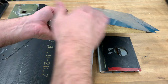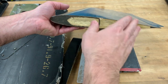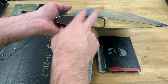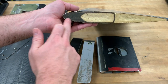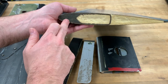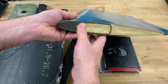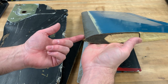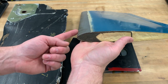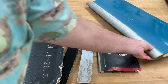Composite blades are made up of a composite material — could be carbon fiber, could be standard fiberglass — but they are much stronger with a longer life. You can see the D-spar here, which is also carbon fiber or composite with a resin impregnated. Inside is standard foam. Leading edge protection is added using stainless steel, because composite isn't actually abrasion resistant, to protect from rain, erosion, and other damage.